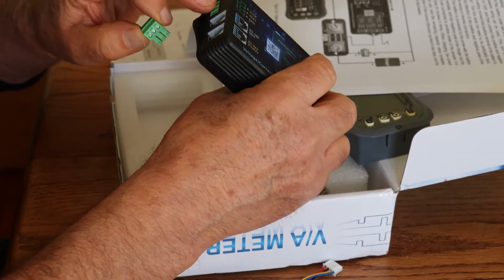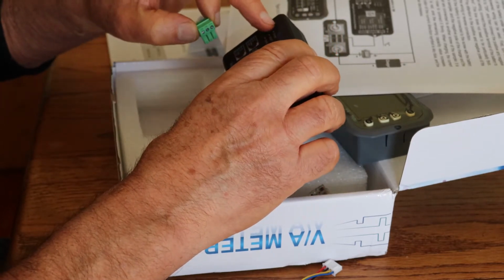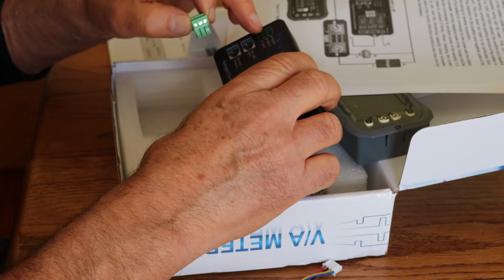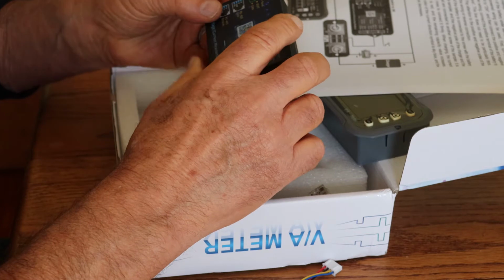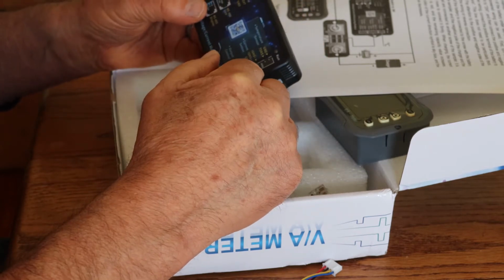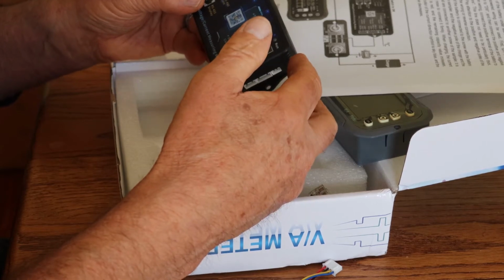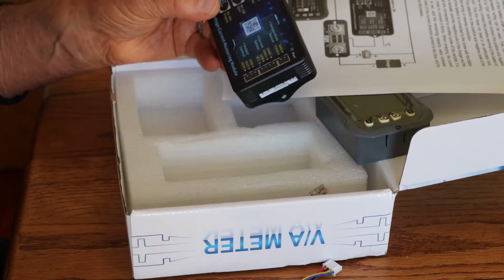We've got this connector here, 3 wires. To wire it up to get this to work, we only really need the one. However, the reason for the 3 wires is if you want to use a relay. Why would you want to use a relay? If you want to use some of these functions on here that allow you to turn on and off alarm features, and that would be why you would want the relay. And we can go into that later, but let's just go through this.